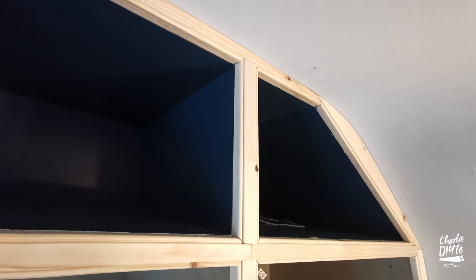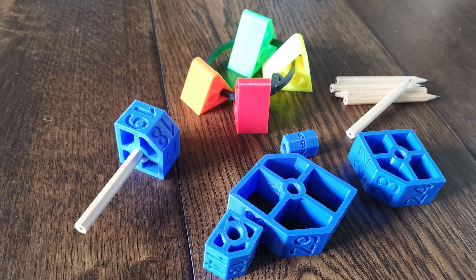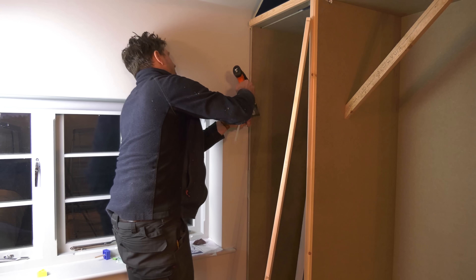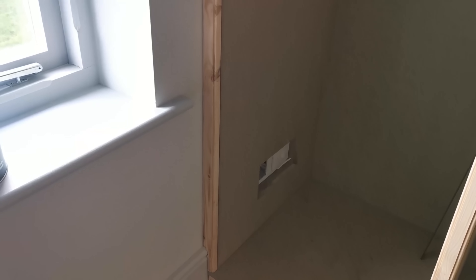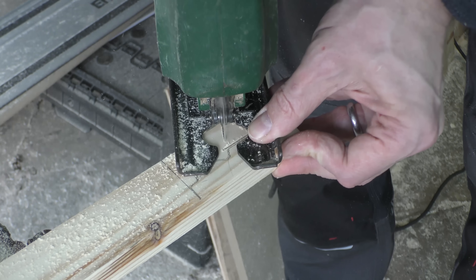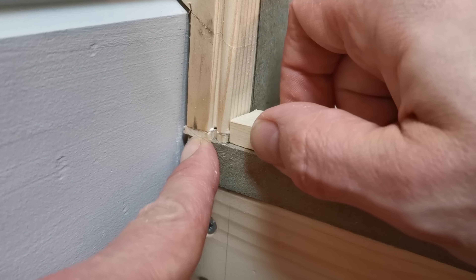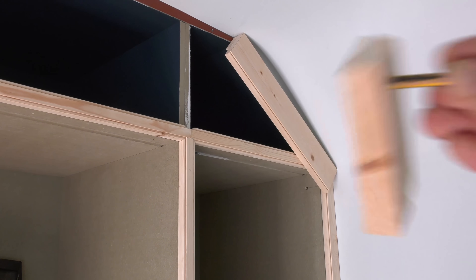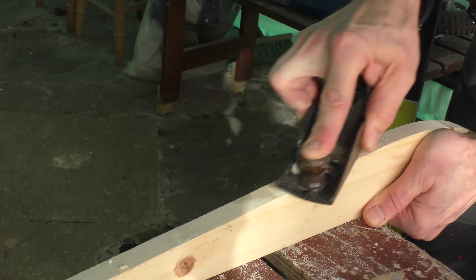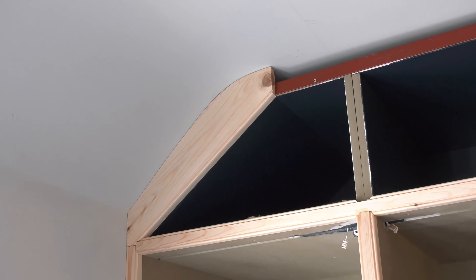Which brings us on to the scribing. The top and side fascias had to be scribed to my uneven walls and ceiling and around the skirting. Where the fascia butted up to the wall I used these swanky scribes which were kindly sent free of charge by the inventor — so thanks Neil for those. Depending on what needs removing, my jigsaw, block plane and belt sander tend to be the main tools for getting that scribed section to accurately hug the wall. For the skirtings I used my profiling gauge and a fine jigsaw blade to get round the angles. In a moment of complete stupidity I cut off the wrong piece of the scribe, which had to be glued and screwed back on with a filler piece. The curved section was too wide for the swanky scribes so I made my own scribe and glued the section temporarily in position with my glue gun, then removed and fine-tuned it with my jigsaw and block plane.